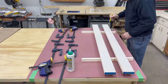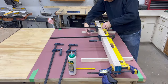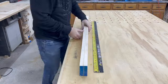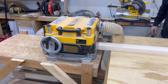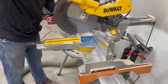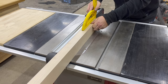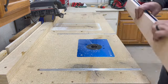Let's get into the build. Starting with a couple of maple 1x4s, I'm going to glue two pieces together, and to keep them as straight as possible, I'm going to clamp an old 4-foot level right to it. Then I'll run it through the jointer to get one perfectly flat surface, square up one edge against the jointer fence, and use the planer to get it to its final dimensions. I cut it to exactly four feet — that'll be the width of my cross-cut sled. Then using a ¾ inch dado blade on my table saw, I'll cut the recess for the t-track, pre-drill and screw in the t-track, and add a ¼ inch roundover to make it more comfortable to hold.